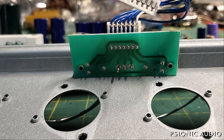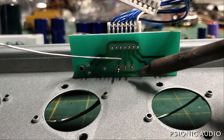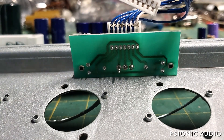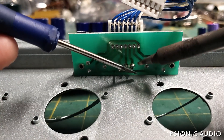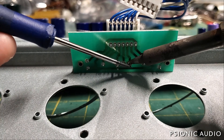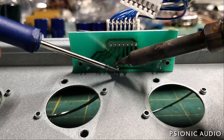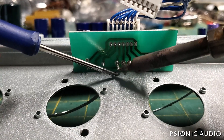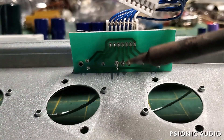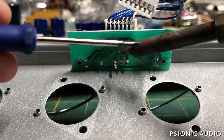Back with the Marshall DSL 100. As I went to put it back together I noticed the bias pins had all broken free of their solder joints, so I'm getting those back to where they were. They're not really crucial — if they break the amp still operates and I don't use them when I bias these — but it's nice to have everything solid, and someone may try to use them someday, so you don't want false resistance readings at these pins.